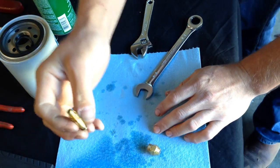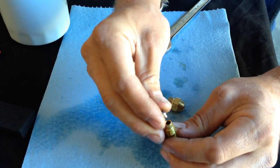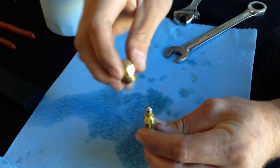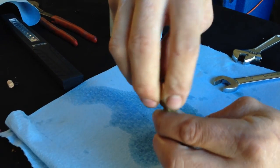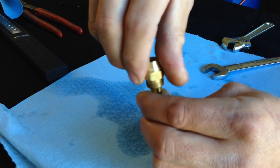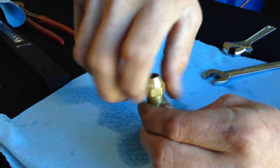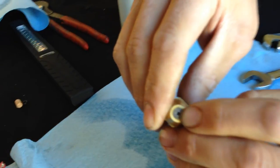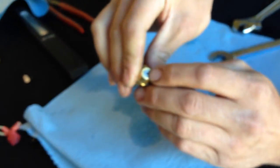This is an important part: when we do reassemble, we want to put the distributor orifice straight down in that stem piece — hold it straight up and down. Then just screw on the cone onto the stem. Make sure you don't cross-thread it. Screw it down finger tight and make sure you can see the hole in the distributor. Once it looks like it's in there the right way, we can tighten it down.